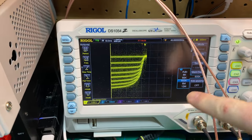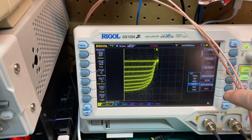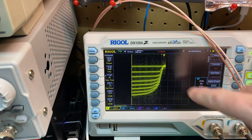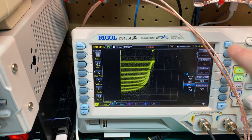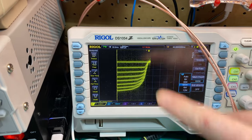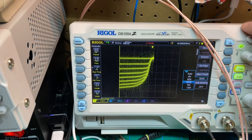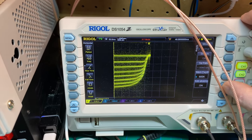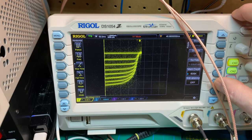So it varies at 600K, 1 mega sample. Not too bad. It's viewable with a little bit of noise, but if you drop that sampling back and mess around with the time base a little bit, it gets quite a bit clearer. I imagine even maybe the anti-aliasing might help, but maybe not.